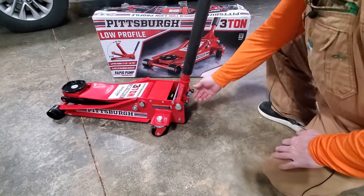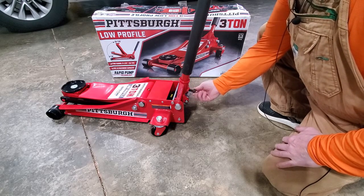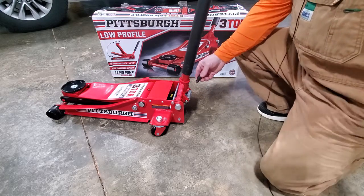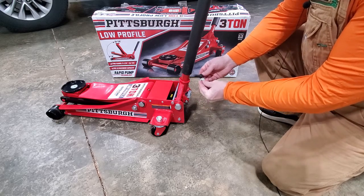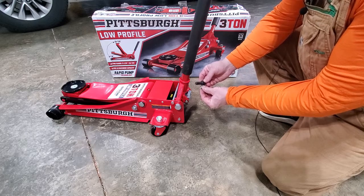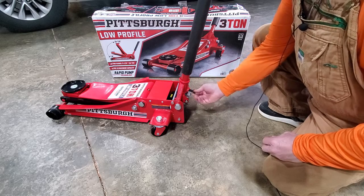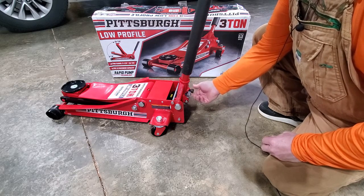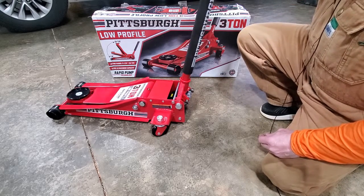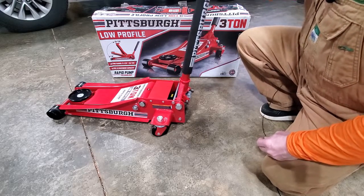So what I did was I ran up to my local Ace Hardware and bought a screw to go in. This wound up being a 12 millimeter metric screw — here's what came out of it originally. This new one is obviously way longer than it should be, but it was the shortest they had. It does screw in there nicely and I'm just hand tightening it. It still allows the handle to turn and it's locked in there now.